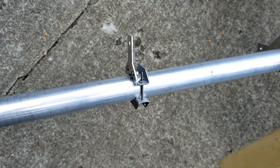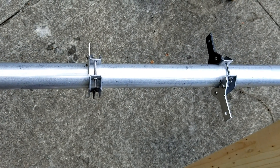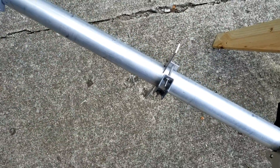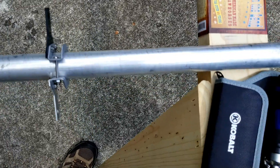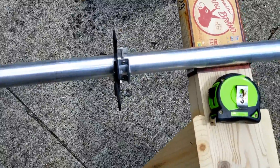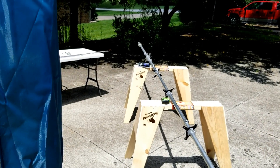It's taken me a little while, given I'm not the best with tools at times and reading directions, but I think I finally have it. These standoffs for the 6, 12, and 17 meter bands had to be metal down on the far end. Here's the base end, then this is the first standoff, second standoff — notice the aluminum is used here and they have to be 90 degrees out. You have to kind of eyeball it and then get down on your knees and eyeball it some more. The black standoffs have to line up with the aluminum ones. These are at certain lengths that I had to measure like three times, and I re-measured again before I tightened them down. So that is stage two on the antenna — got the standoffs. I'll be back with stage three.